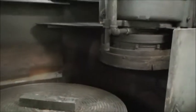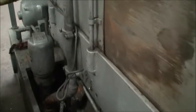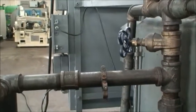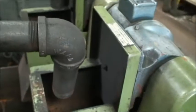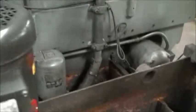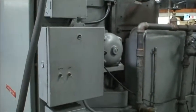This machine has the coolant internal in the base, and it's pumped to this area over here. This pump will then pump up and over into this setup here. It gets dumped into these filters here, and then into this large tank where it's pumped back up to the machine. So in general, it's got a nice coolant system, both internal and external. Here are the controls for the coolant system, the external system.